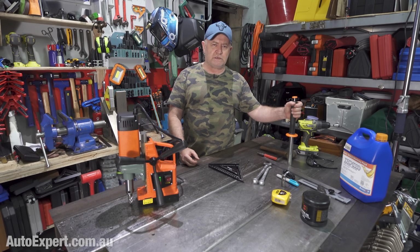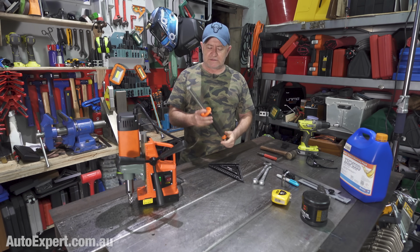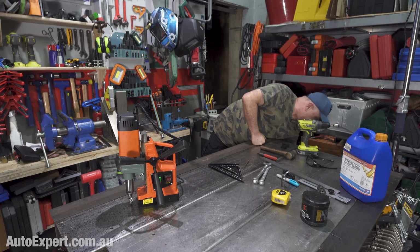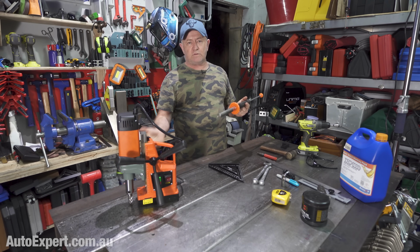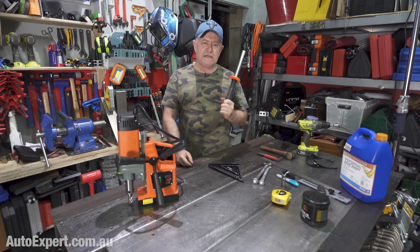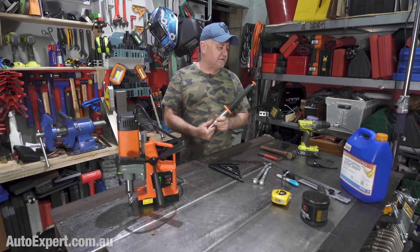And the other thing that's really good for fishing it up in bulk is one of these babies. These swarf wands are fantastic. You see a bit of offending swarf, you just pick it up like this, and then you take it over to your bucket and turn the magnet off and it all just falls off. If you try picking it up with a vacuum cleaner, it's just going to clog things up all day long, whereas this is a super efficient way of doing that particular job.